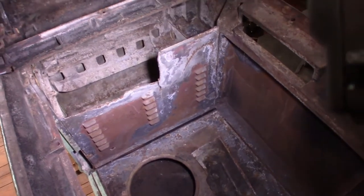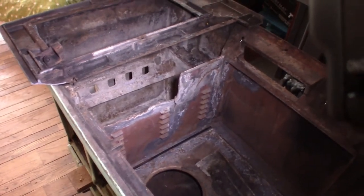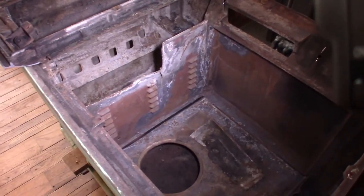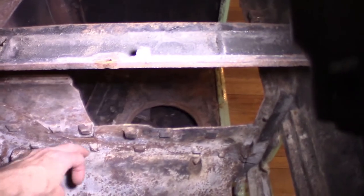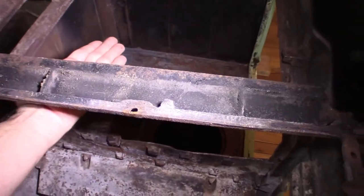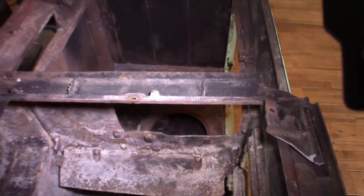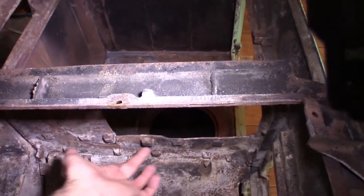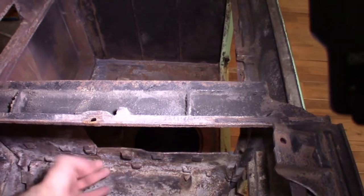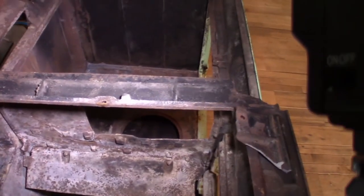I found an epoxy that's supposed to be good up to 2400 degrees. I thought about just coating the backside of it with that epoxy and then making a steel heat shield that would go basically from this edge up and then roll over top of the oven slightly to help keep the direct heat off the back of this oven. There are little protrusions here that would help create an air gap. So that's one of our thoughts there.